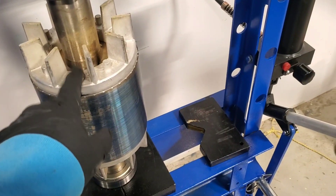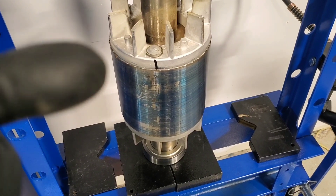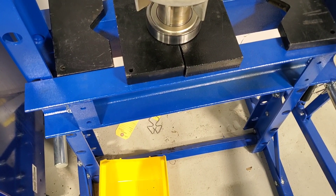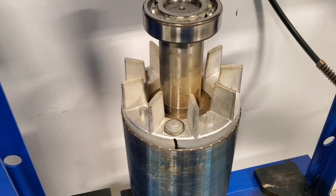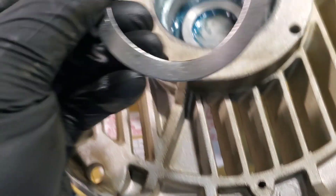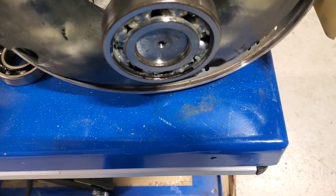The only reason I didn't use the press in the first place is it's heavy and I didn't want to be hauling it around. I can usually do the motors in the stators as long as you're careful and don't beat them up too much, but it didn't work out that way. Open side of the shielded bearing goes to the bell housing, and the shielded side goes to the inside of the motor — that's how we like to set them up. Do not forget the wavy washer goes in the non-drive end up against the bearing — don't leave it out. Also don't forget the funnel for the air cooling.